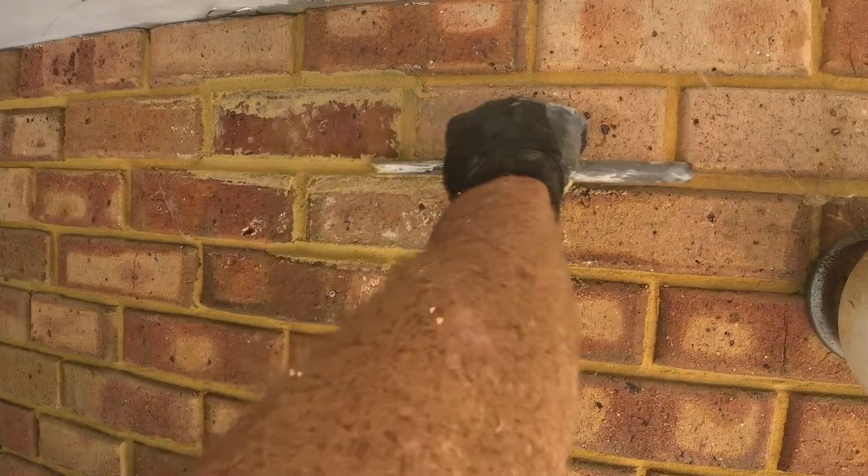And you would have seen me stuffing that hole from the other side. You're probably wondering why. That's because that's where the air conditioner is. So by putting it in the back, it gave me a backing. So now I could do that up the front. I'll clean that and I'll plaster that, make it schmick. But that's all it was really. Because they'd drilled through the two bricks, we had to take those two bricks out, put in two more, and that's how to fix it and patch it. Save you getting a brickie out. Maybe save you a bit of money.